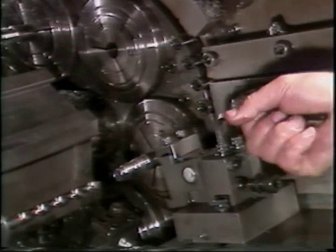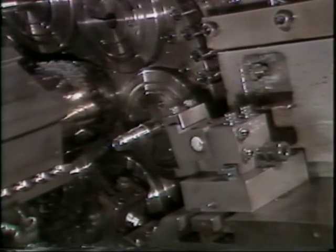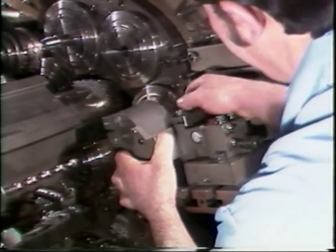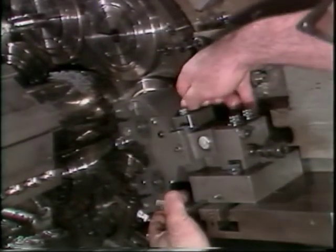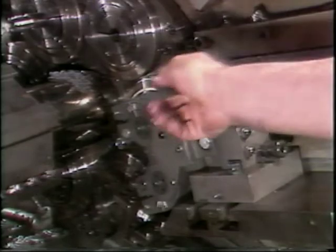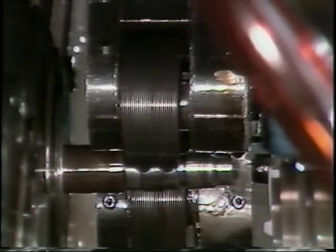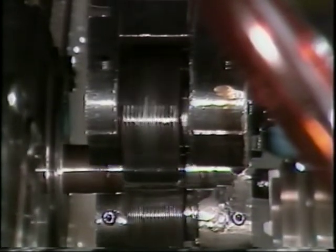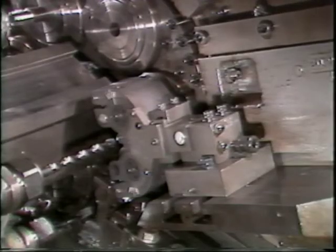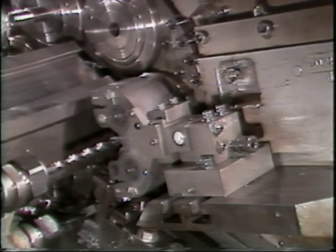Lock down the screws. The depth is now set. This will bring the thread rolls just over the center line of the blank. Hand crank the machine back. Insert the thread roller head and tighten the holding screws. Run a part and check it against your layout sheet. As with other setups, final adjustments will normally be required to produce the high-quality threads needed to meet part specifications. This completes the television training tape on the thread rolling attachment. You may watch this tape as many times as you need. When you are finished, return to the operator booklet for your next step.